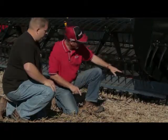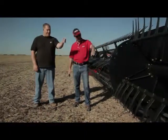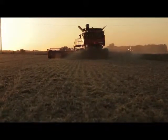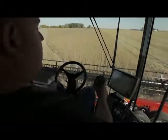With the new 3000 series line of draper headers, part of our goal was to provide a head that would perform superior to our prior header. In dry field conditions on relatively flat ground, you won't see any significant differences between our prior header and our new 3000 series header. But in varying ground conditions where we need the ability for the cutter bar to flex, we have advantages that will help put more grain in the head and ultimately more grain in the tank. With a design that is very simple and easy to adjust, it can handle a wide range of crops and conditions. You can start earlier in the day, harvest later in the day, run at speeds anywhere from a half mile an hour to a mile and a half an hour faster, cut uneven ground shaving close to the ground, and harvest more grain and more acres per day.